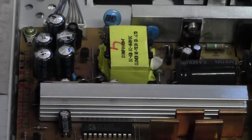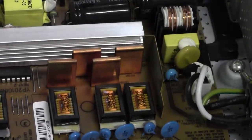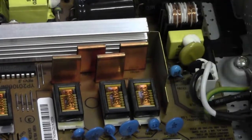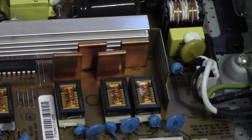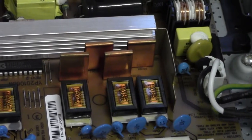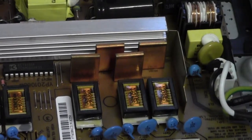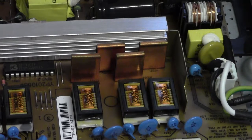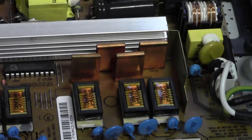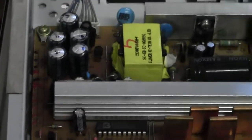Nothing particularly special. One thing I'm not too keen on, as usual, if you've heard my repair videos before: down here on the mains side, bloody colour coding, white and black. The earth is green, that's fine, obvious, but what is white and black when it's at home? Why not blue and brown, your live and neutral colours? If this was looping all about the place, you might end up getting those around the wrong way if you're not careful. But short run, we can see what it is from the sockets. No biggie, but it would be nice to conform to some sort of standardisation. We do have set standards.